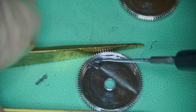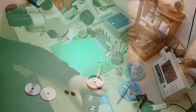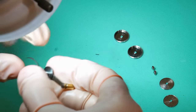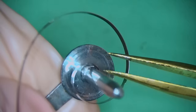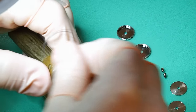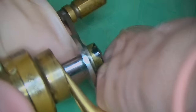The first thing I'm going to do is tackle the mainsprings, treating this with the same respect I would any watch service — the same oils, the same greases. First I'm applying chrono grease — that black stuff — it is a braking grease used on automatic watches, very expensive but very important. I'm also putting the mainsprings into my winders so I can put them back into the mainspring barrels. Of course we're doing everything twice because we have two barrels.